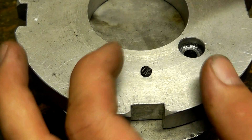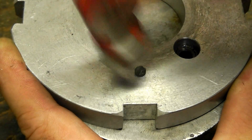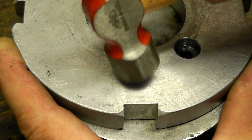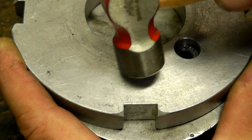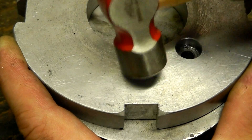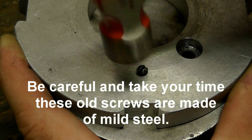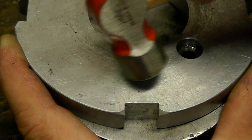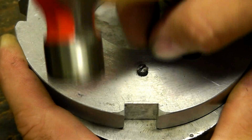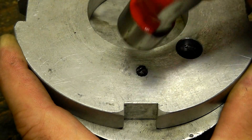We're going to take and work the top of this screw - that metal that has been twisted out of the slot - and we're going to lightly tap it and form it back into the slot, just a little bit at a time. This is mild steel you're working with. This screw was made back in the 1870s or 1880s - it's an 1879 rear sight, so that's probably when these screws were made. It's not going to take a lot of force to push that metal back into the slot. The screws aren't going to look perfect when we're finished, but they're going to look a lot better than when we started.